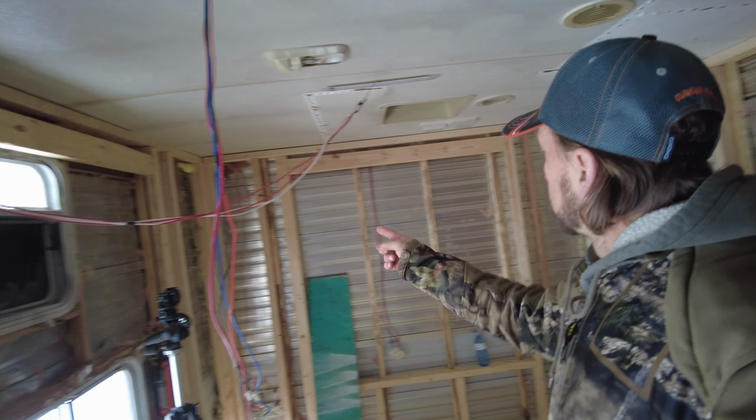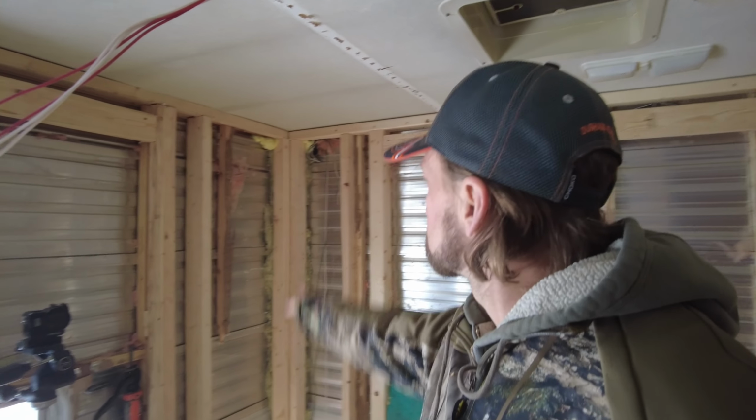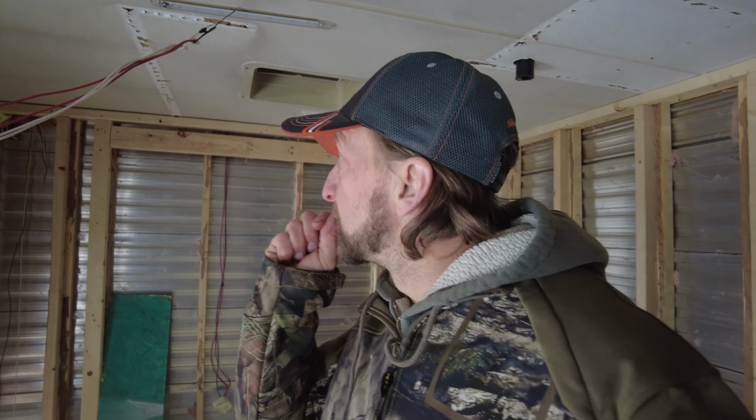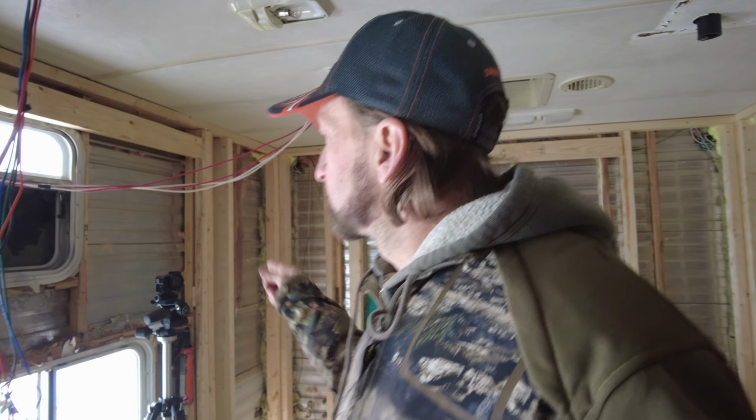So I'm going to insulate these two walls here. And then I had a thought last night, I'm going to put in a brace along this wall here up against the siding, so that I can have something to screw the WeBoost antenna onto. I'm going to do that after my hands warm up a bit, but putting the insulation in here will definitely help that, and getting the fire going as well. So gonna get that all insulated, post in, get this all insulated, get this polyed up, and that's it. It was hot anyway, but it's gonna be really cooking now.